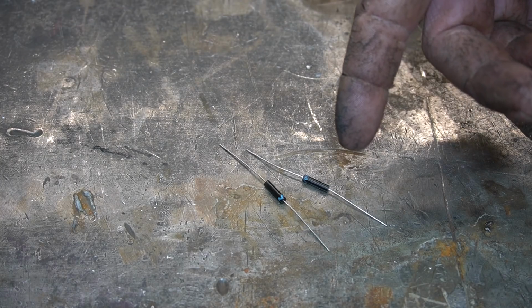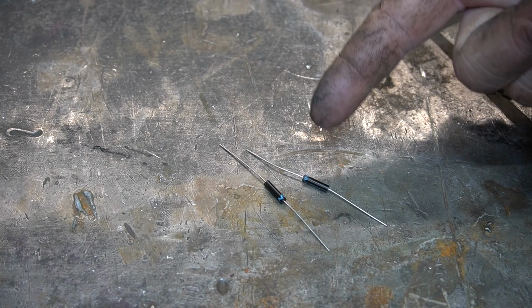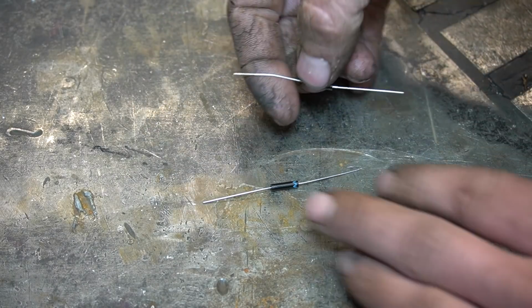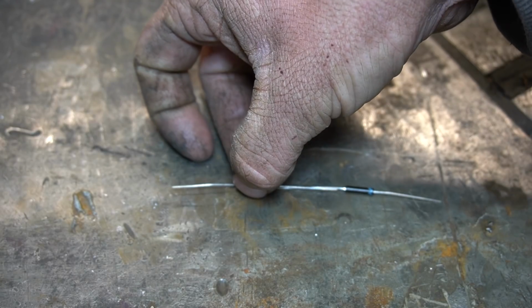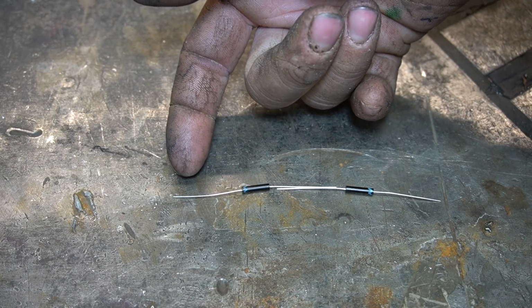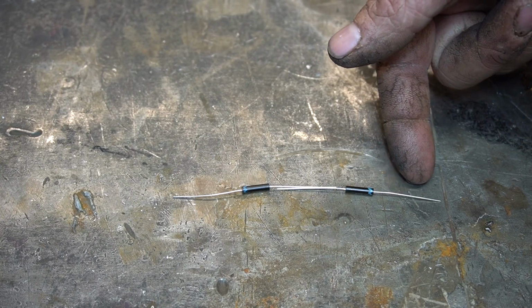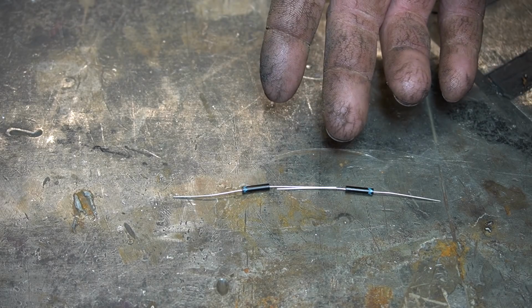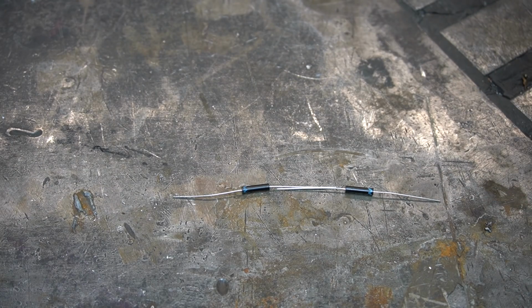Now we're gonna have to rectify this voltage, and because of the way that the neon sign transformer is built, we're not gonna be able to do a full wave rectification. It will be a half wave. To make the rectifier, I've got a couple high voltage diodes. These are rated for 20 kilovolts, so we should be fine. And if I'm not mistaken, we need a negative voltage, so we gotta put these backwards, like so. This will be one end of the neon sign transformer, this will be the other. Between here and earth ground will be our voltage potential. Let me solder these together.